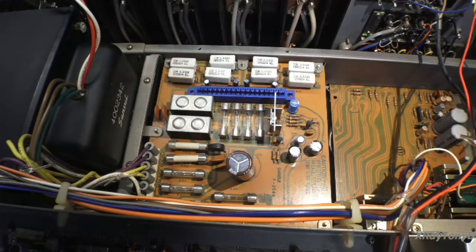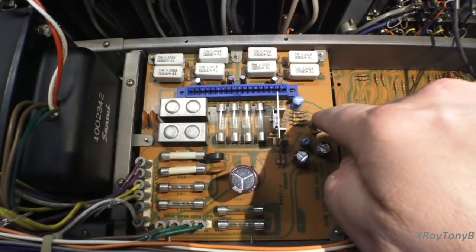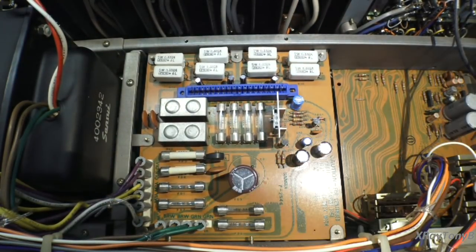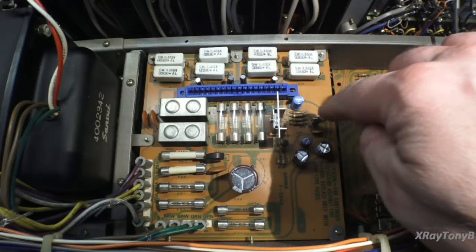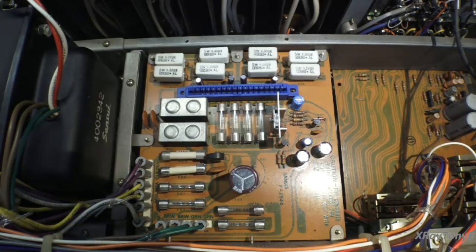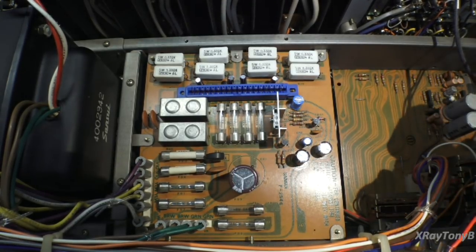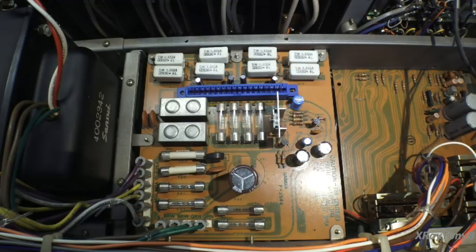Here's where we are right now. I've begun the recapping and restoration of the receiver. So far we have the power supply board done — all the new capacitors are in. I also replaced these three power transistors with heavier duty ones. The ZD01, a 13-volt Zener diode, was off by about three volts, which isn't uncommon — I've seen these drift before. I put a brand new diode in there and that brought the voltage perfect.